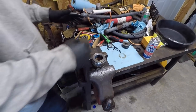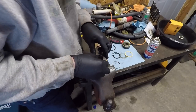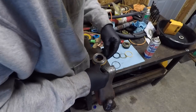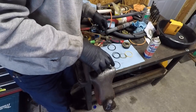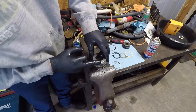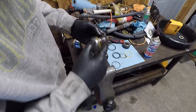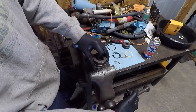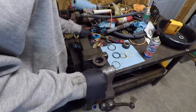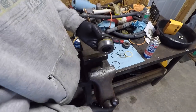Now we will move on to the outside of the end cap. Pay attention to the order these come off in. Here's our new little orange flat ring — this ring will end up flat once we get it down in the groove. It goes on the bottom from our perspective here, then our new O-ring is going to go on. O-ring, spacer — now we'll flip it over and replace that O-ring. And when you clamp it in the vise, go down past your sealing surface. Just roll your new one in there, and that's it for our end cap — set that aside.